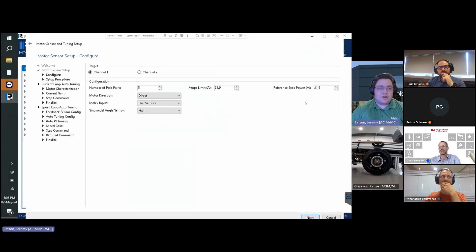The motor direction needs to be set depending on the application. Since we are using our dual channel motor controller in an AGV application, we will set channel 1 as inverted. In electric vehicle applications using differential drive, setting one motor direction as direct and the other as inverted will result in the vehicle moving straight when a positive motor command is issued for both motors. Always test with care.